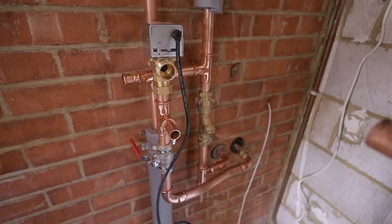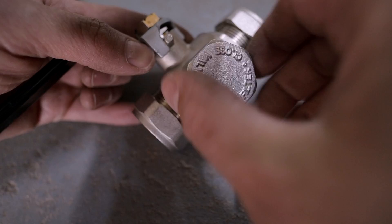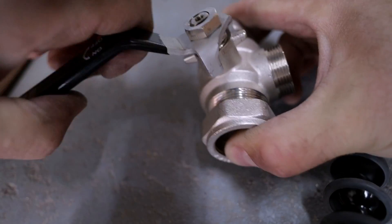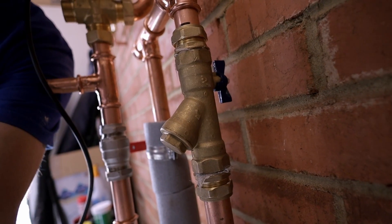This situation is more open so the unit might have worked on the floor, but I'm not going to risk it in alleyways anymore — I'm lifting units up because cold air naturally drops to the bottom, which should help it dissipate before the unit recirculates it. My pipework in the plant room is now completed. On the return we've got a Y-strainer — you can find those from Intatec and other companies — but I no longer use the ball valves with a built-in strainer because the pressure loss on those valves is huge. Y-type strainers have a much lower pressure loss.